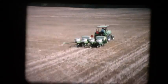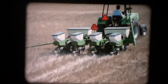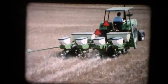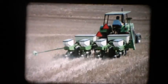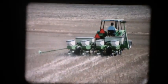The closing discs also slice off bands of soil from the side walls of the trench and shift that soil laterally over the seeds. Good seed contact with this warm topsoil results in faster germination. The upright position of the opening and closing discs, and the planter's weight acting on them, ensure excellent ground penetration, resulting in uniform depth of planting and good covering of the seed.